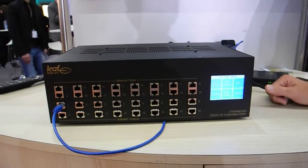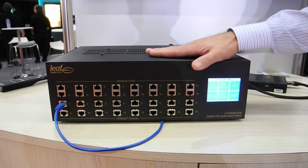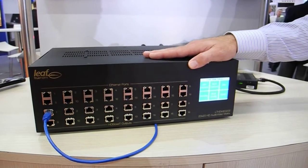Now this is an unusual design, with regards to the connectors on the front. The main reason we've done this is from an engineering point of view — we've tried to reduce the amount of PCBs we use, because when you're talking about very high bandwidth as you are with HDMI, every point of connection is a potential point of failure. Within this main board we only have two PCBs to run the whole 20 sources and 20 zones, and we only have one connector between the PCBs — a high quality, high speed, 180-point connector.